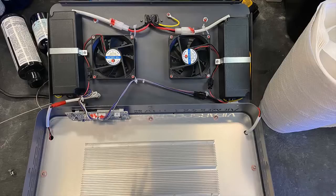We don't have the CE marks and stuff anymore. Kind of a disappointment. But there's actually a little control board in there. That's probably because they might be controlling with PWM now instead of analog. It's hard to say exactly. Yeah, because this is different, I don't have an analog control. And for those wondering what PWM is, it flickers the light off and on at a different rate so that it looks dimmer or brighter to the eye.